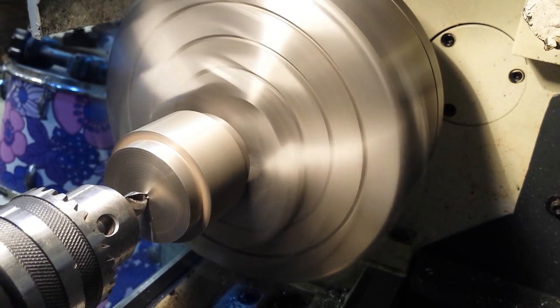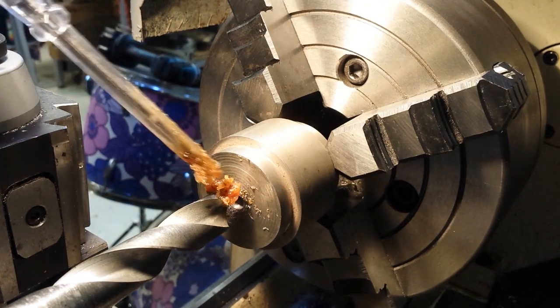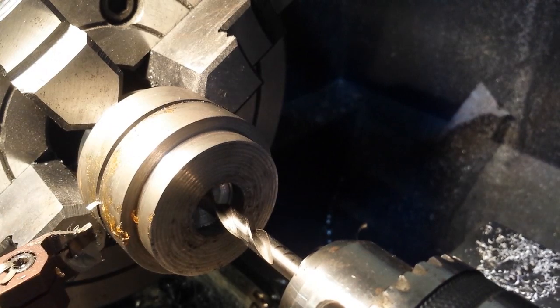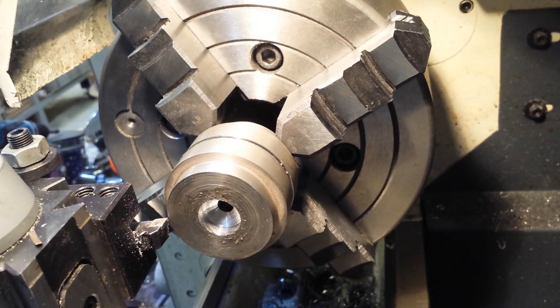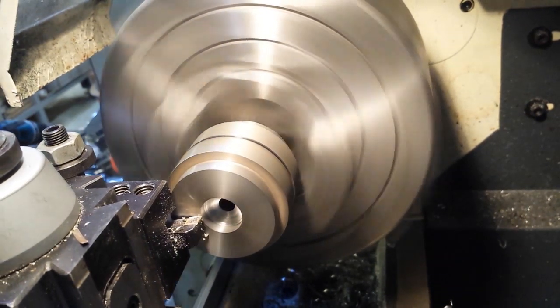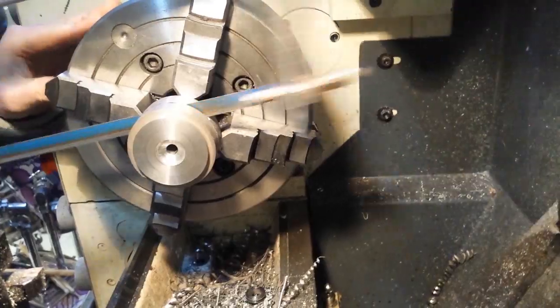To make the parting off easier and just to save some time, I'm drilling a fairly big 20mm hole in the centre of this in increments. Here's the nice earwax cutting wax stuff that I use. There's something about parting off when it works that's just really satisfying. The ribbons from that weren't awful, but I think we could improve that with faster feed or speed. For this face cut, I'm going dry carbide, 1mm depth of cut. The chips are curling up really nicely. Excellent finish as well. The parting off tool doesn't go deep enough, so it's back to the old elbow grease to get this off.